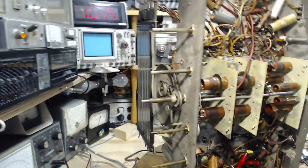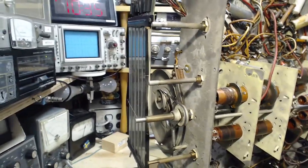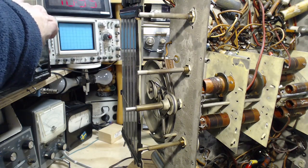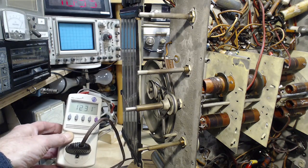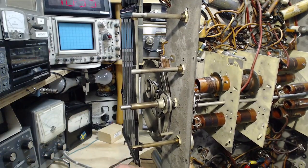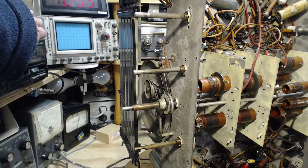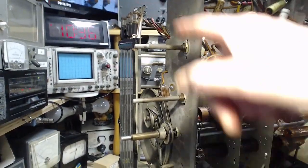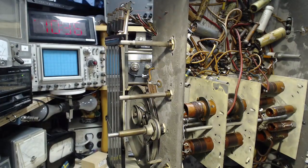Keep an eye on the light — if it comes on really bright, we'll stop. Here we go. Nothing has happened visibly. We're reading full voltage: 123 volts, no load drawn — that's good, because the radio is off. Now I'll turn the power off and then turn the radio on. There we go — the panel light came on. We know which band we're on and that the 6.3 volts for the panel light is working.